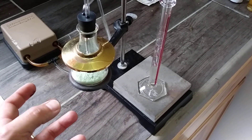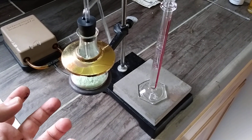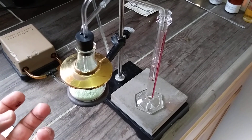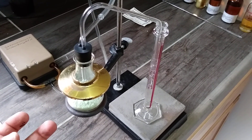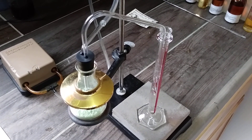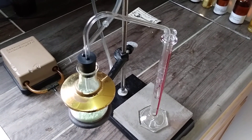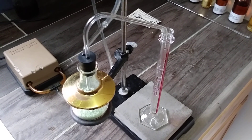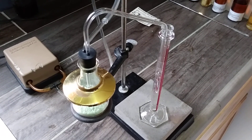It's a mineral that, when heated to 1256 or so degrees Fahrenheit, will break down and release white fumes. And those white fumes consist of sulfur trioxide and sulfur dioxide that will combine with atmospheric moisture to make sulfuric acid. You can then take that sulfuric acid solution and boil it down and concentrate it until you get a yellowish colored oil that is oil of vitriol, or concentrated sulfuric acid.